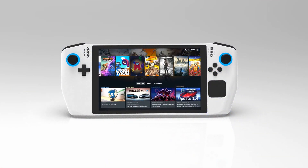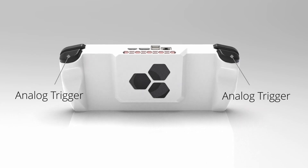I'm going to focus on the controller for my Zendeck project, so let's have a look at what it needs. Since I have two joysticks and two analogue triggers, I'll need six analogue inputs in total. I'll need at least 15 digital inputs for the face buttons, shoulder buttons, and joystick centre clicks, assuming I don't end up adding any rear buttons to the controller grips. If you're planning to add any extra features like RGB lights or rumble motors, make sure you take them into consideration too.